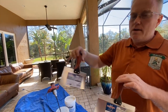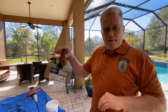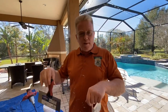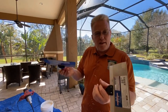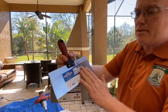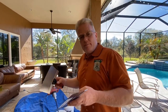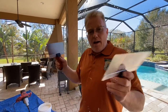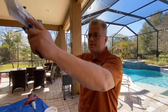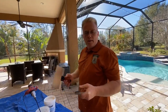For those of you whose hand is hurting, if you guys are doing this, I suggest you go with an 8-inch. They'll last you a nice long while. But you have to store them properly. You just can't throw them up against each other. They can get nicked, and then you got to sand out the scratches. And for those of you whose hands can tolerate a little more, this will help you get the job done quicker, but it's a 10-inch. And for those of you who want to use both hands, sometimes we have to do whatever we can to get the job done quicker. You just do this, two hands on the wall. And you use the 10 inch with your stronger hand.